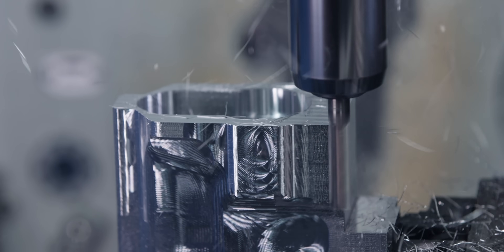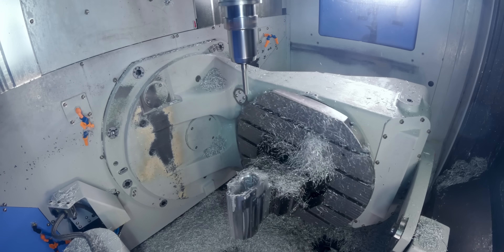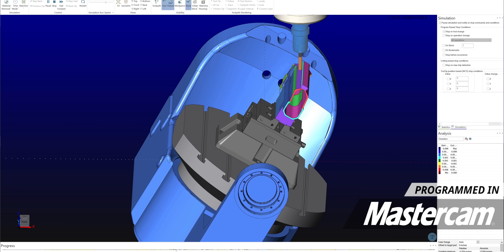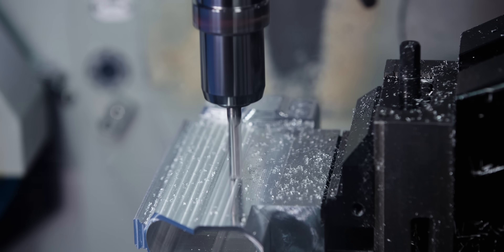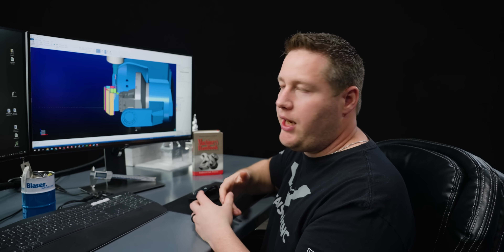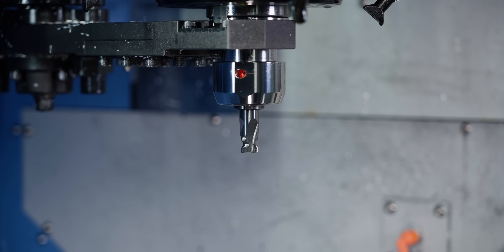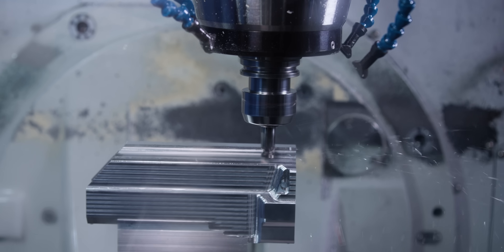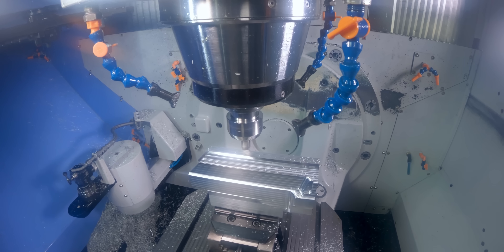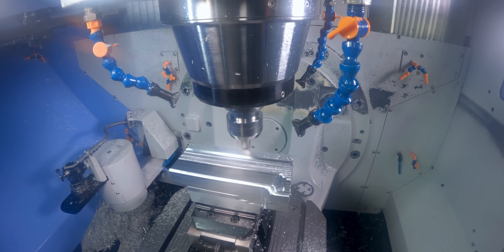I've got to hand it to Mastercam — I love the direction they have taken their multi-axis modules, because not only are they extremely intuitive, they give you several options for machining strategies. Normally you don't have that luxury when something is that intuitive. For these pockets and holes on the face, I'm going to come in with a small drill and drill those out just to get rid of the bulk of the material. Next, we're going to come in with our Picatinny form tool. We could do this with multiple tools, but it's just easier and I know the shape is going to be correct with a form tool — so I just have to make one pass down each side and that whole Picatinny rail is complete.